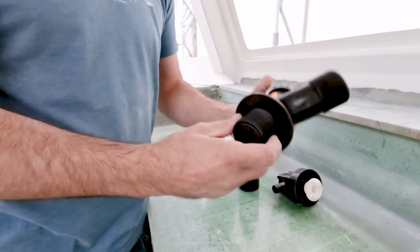So I'm mixing in some glass pieces because this is going to be a pretty large vinyl ester puck that is going to be in that decored section. And in case we do bump into anything with the bottom, I want to make sure it doesn't split and crack apart. So this is going to add just a little bit of strength to that and hold it hopefully together. This is just in the part that's going into that core section.